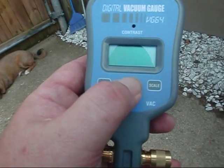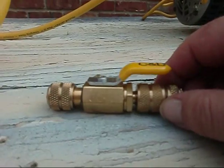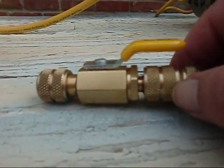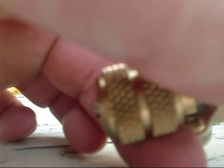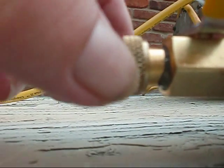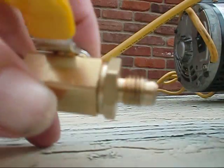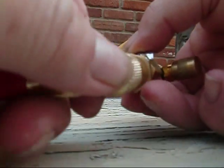Got a little hanger on there — nifty. Alright y'all, we've got our core remover here. What we're basically going to do is we'll have the valve open, and then we'll take and unthread our schrader and pop it back — this is still sealed here. Then we'll isolate by closing our ball valve here. This is attached to the unit now — this could be the suction or liquid side, either or. I've got two of them.